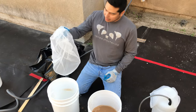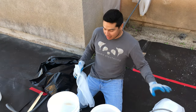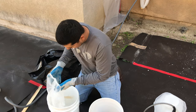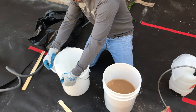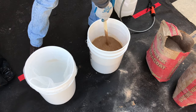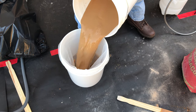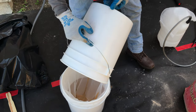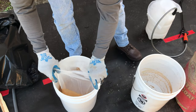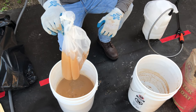Your next step is to get a paint strainer. This is very, very important — if you don't have one of these, your sprayer is going to get jammed up and you won't be able to use it. So this is a very important step. You grab one of these and put it over your bucket. This has already been sitting for about 10 to 15 minutes. You take off the strainer and this will get rid of any big chunks that are going to clog up your pump.